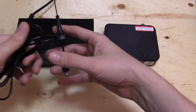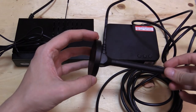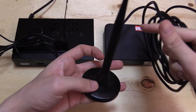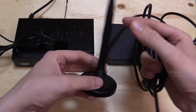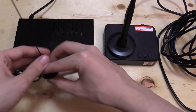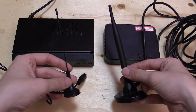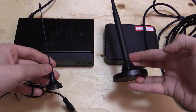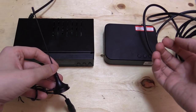Another difference between the boxes is the included antenna. This is the one that comes with the WoW group box and this is the one that comes with the TV Plus. You can see that the TV Plus one is much more substantial — it's got a thicker wire, it's got a much longer wire, which means you can run it to a better location because sometimes you have to get it either outside or near a window or very high up. I like the fact that it feels like a really sturdy antenna. But how do they actually perform side by side in terms of signal? In my location I can't tell any difference between them — they both seem to give the same signal quality and strength, but you can tell that the ABS-CBN one is built to a much higher standard.